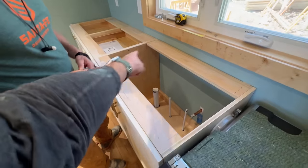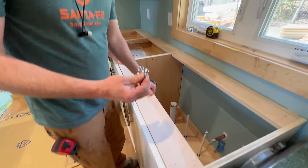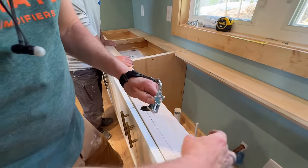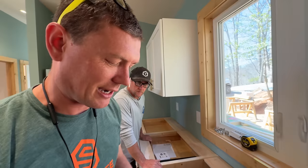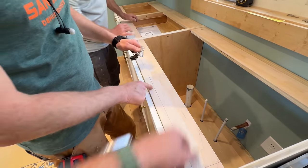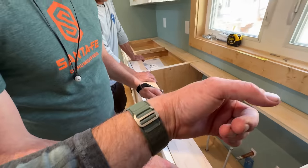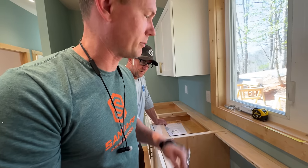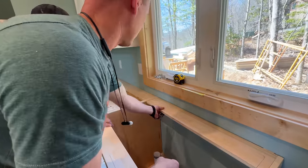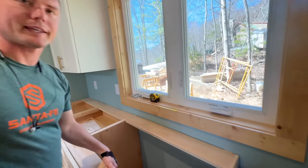Jamie's marked where the sink cutout is on the cabinet. I need to cut back a little more — this is the clip that's going to hold the sink in and I don't think it's long enough to capture this additional three-quarter inch thickness, so I think I need to cut back from this line about a quarter inch. I'm a little scared of chewing away too much of it. In the back I could probably just cut that straight across and let that fall out — but there's a screw and I can't get to it.